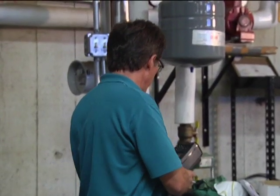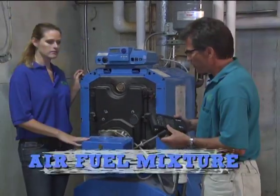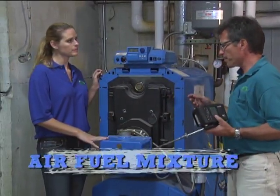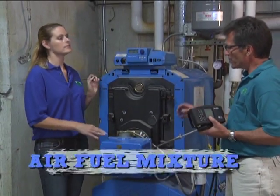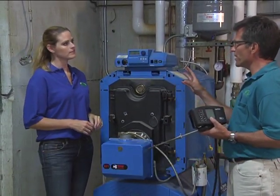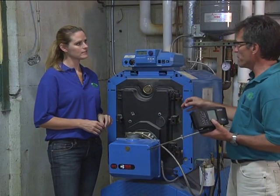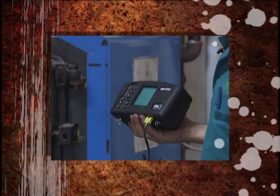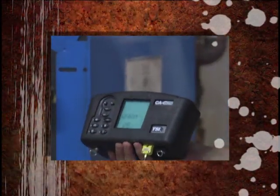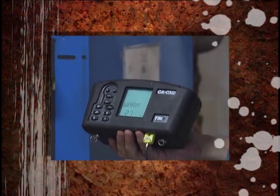So we have these electronic gauges here. The air-fuel mixture is the proportion of air that's mixed in with the fuel. That nozzle atomizes the oil, and we also bring air in there to help atomize it as well. We have this gauge that we stick in there, and when it's firing off we'll measure carbon dioxide percentages and adjust it accordingly.